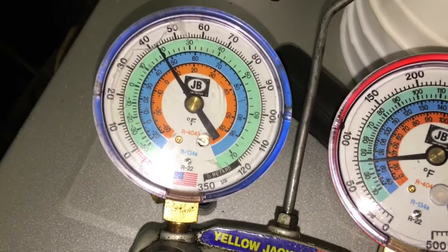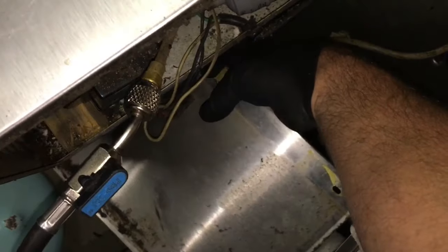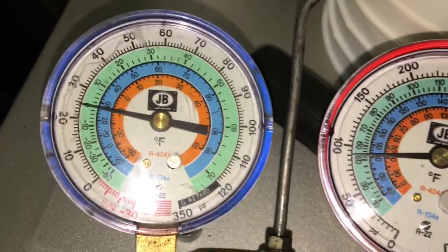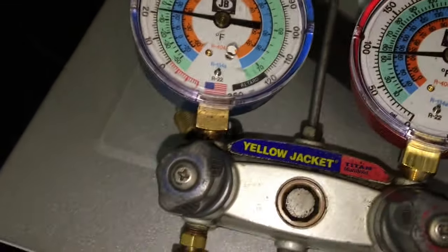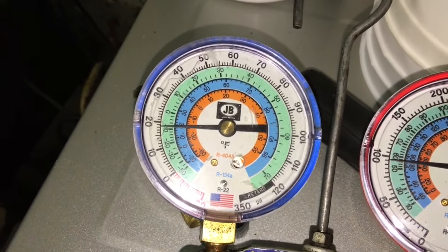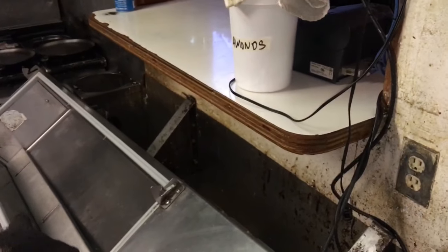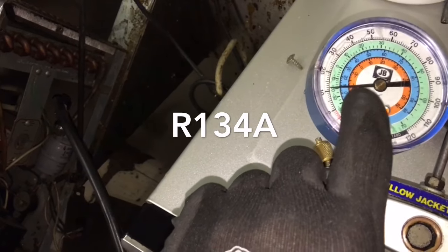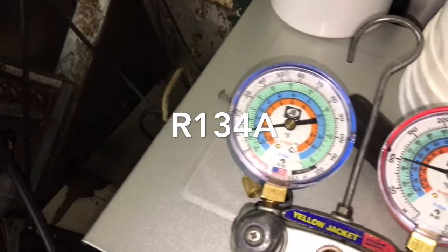I got the analogs out today because it's just kind of fun. So we'll fire it off. We'll turn it on and get it running — we're back to running. We know the suction pressure is going to come down. Now with the static rail, you might be around a 10-pound suction, which would probably put us at about a 10-degree evaporator.